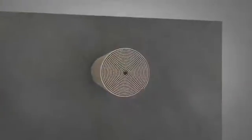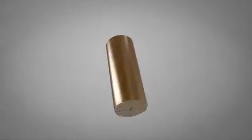This flexible layer structure then goes through a winding process and forms what is called a jelly roll. For prismatic cells, these structures are cut and layered, flatly rolled, or Z-folded.